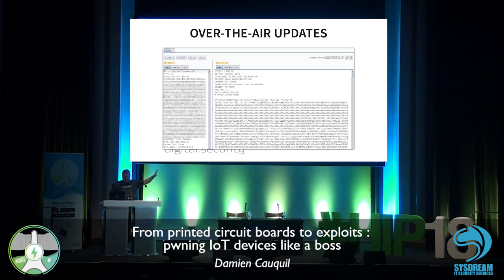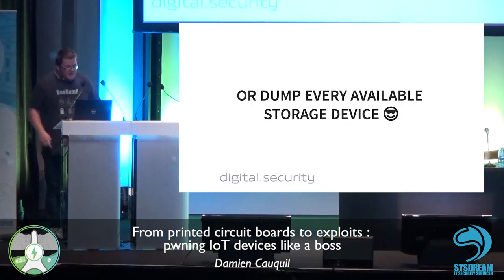This screenshot I'm showing you here is the exact firmware, the OTA function, a feature of the smartphone application that comes with this smart lock, used to put the firmware inside the device. It's Base64 encoded, but you can get it very easily. So based on this, I got two versions of the firmware: one extracted from the device itself, and another one extracted from the remote server.